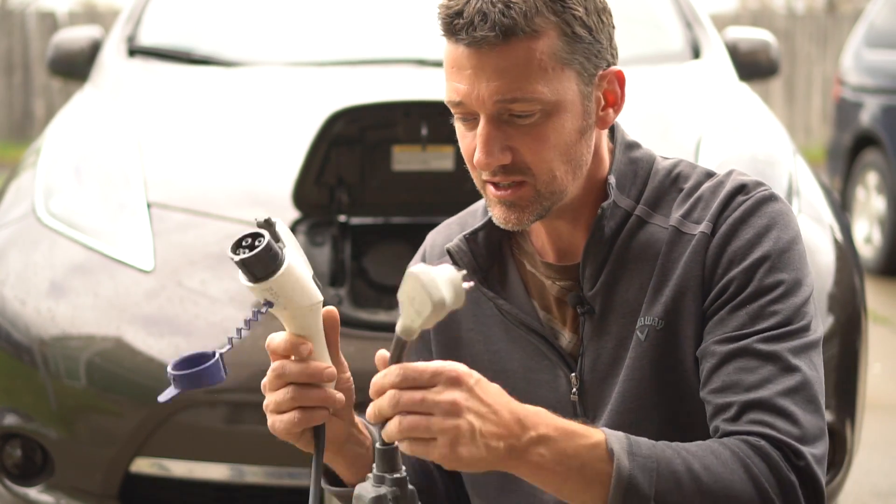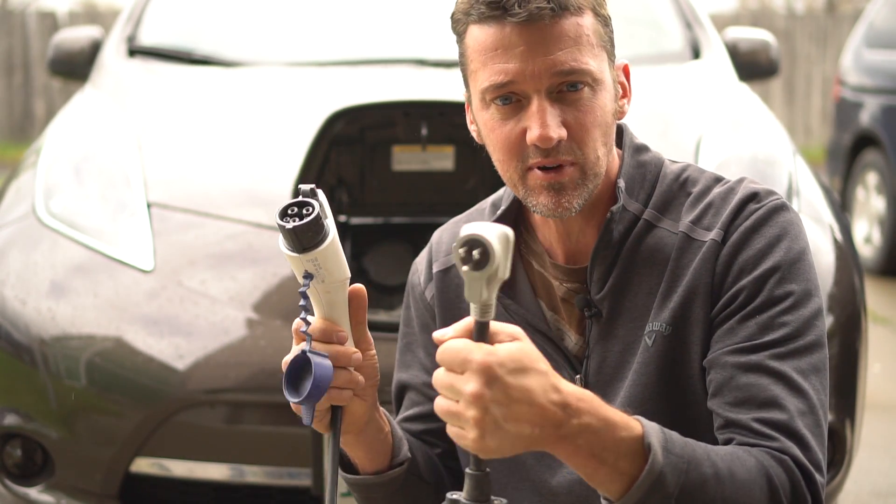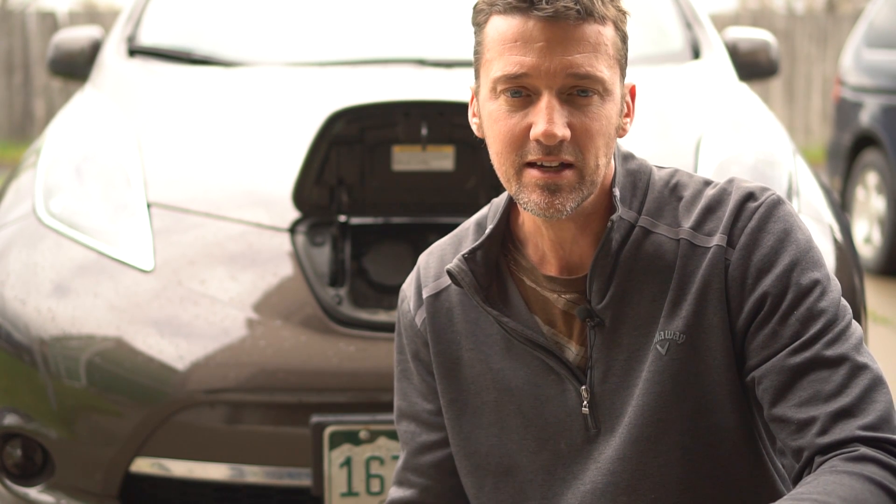Because no matter how big your car's battery is, it might take multiple days to charge if it's drained to empty — like in the case of a big Tesla. Even with just the basic charger that every car comes with, that plugs into a regular plug, that charging cord adds about four miles of range per hour. So if the typical person parks the car at night and plugs it in from 6 p.m. to 6 a.m., that's 12 hours of charging — it's going to add about 50 miles of charge overnight.